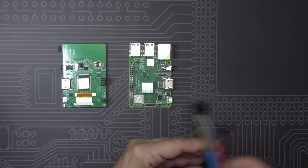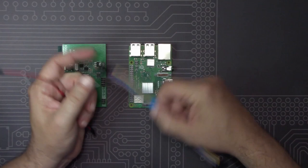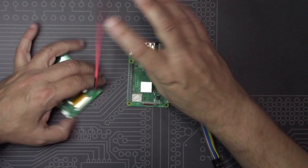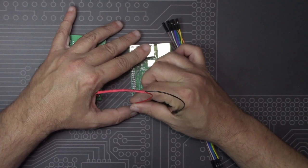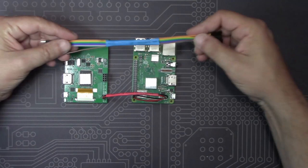What we did for this is create a set of jumper wires. I have this set for power and this set for the other GPIO pins. Each one of these is color-coded and they'll connect into the screen as I've illustrated in this diagram. So now to power the display, I just plug the wires into here and then connect them to the board like so. There's red. Alright, there's the black. So that's the power. I'll do the same with these wires for the touchscreen, and this will route very nicely inside the case.